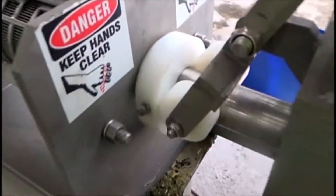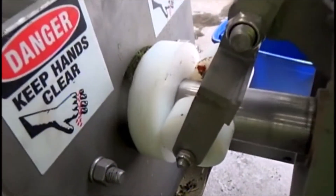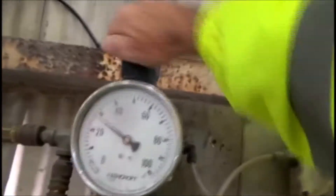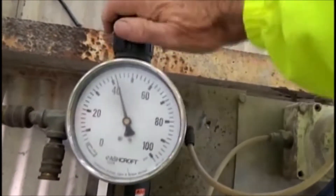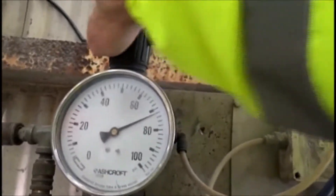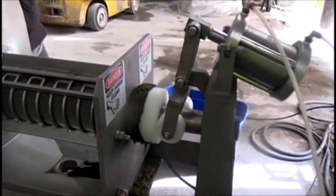I missed some of that video, but I closed this cone. The cake is starting to come out here, but there's no liquid separation at all. So I'm going to crank up the air pressure — I think it drifted down on me. I'll go up clear to 75 PSI. Okay, getting some oil out at 75. PSI does it.